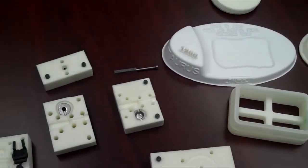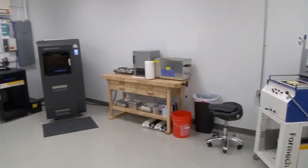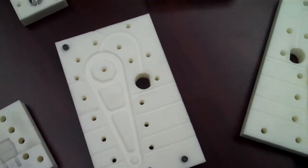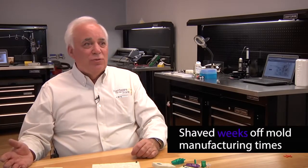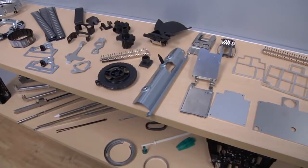To get an insert molded part in two days, you wouldn't even get close with a machined mold, and you wouldn't get this kind of quality. Traditionally, if you want a molded part, you buy a metal mold — it'll take two to three weeks to make it and cost $6,000 to $7,000 depending on the part. We were able to take that same part and reduce the mold manufacturing time from two to three weeks down to a day — 12 hours. If we get files in the afternoon, we can ship parts the next day.